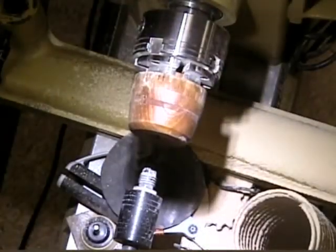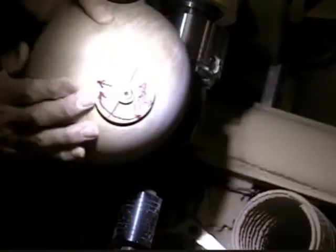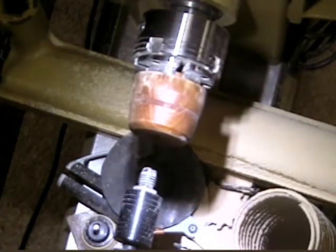And like here, you can see the marks. Over here, in all honesty, those marks almost disappear. And I almost guarantee you it's because we didn't go through the same progression of sanding 90 degrees. So again, where this half circle is, this was what I just did, where I alternated spinning it on the lathe, sanding by hand, and then the same grit, I'll do it with the small sander. And again, this gets to like the 320.